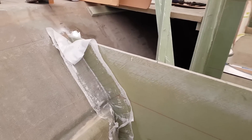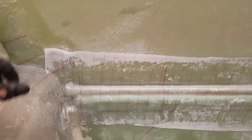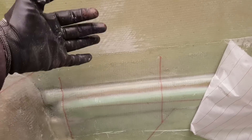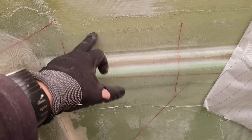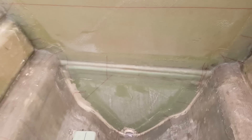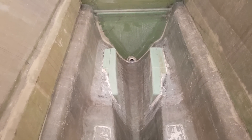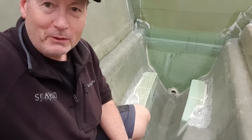I've got the tabbing completed on the reverse side of my bedroom bulkhead — the engine bay bulkhead. Getting the peel ply off now to examine the strength. I've got the rear bunk, the stern cabin bed bunk, then the floor, the riser, and then the bulkhead — all glued with epoxy. So there are four layers glued together with two layers of 600 double bias over the top. It doesn't get any stronger than that — pretty strong joint. That engine bay is now ready for laminating over those foam bolsters so I can get my bearers in place. I'm back in the bilge — been down here for a few days.